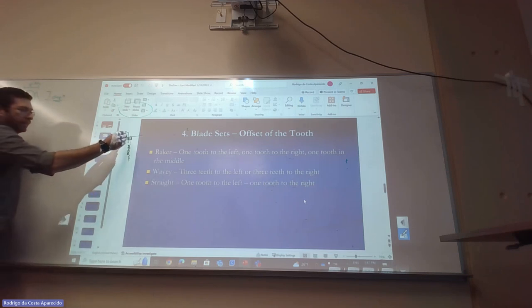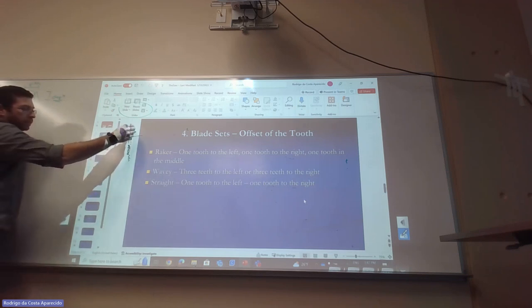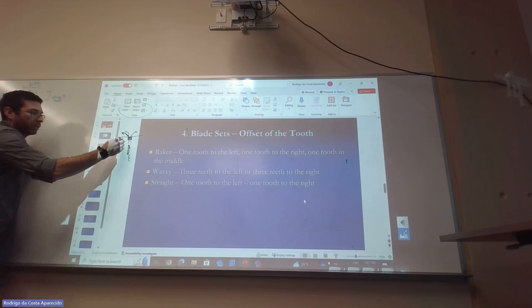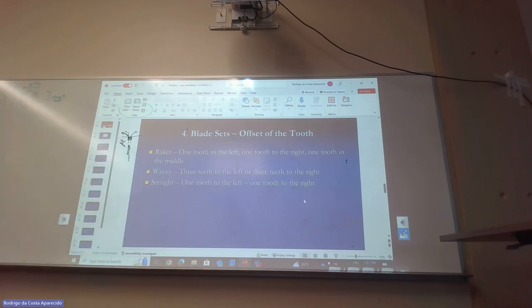And I take this material, dump, take that material, dump, take this material. It's like there's also some time for this side to cool down before I cut it again. It's the same as adding clearance between teeth, even though this one pretty much has no clearance. By waiting to cut this side again, it's actually the clearance that I get. Right?